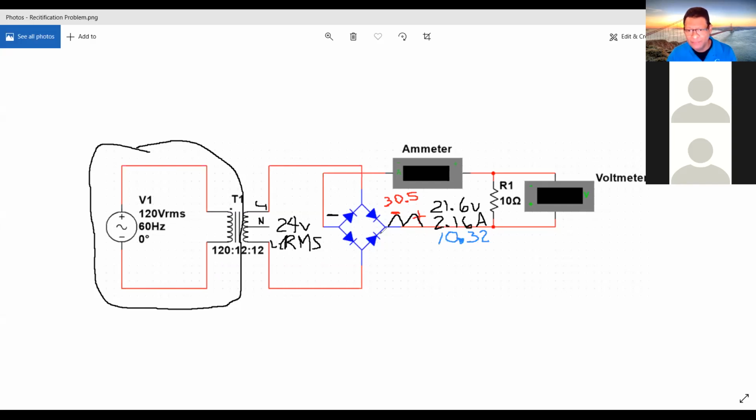So why is that important? Because this is the same thing that you are going to get in the shop once you get back in the tools. You are going to have to look at the schematic diagram, connect it, and then do all the calculations as well. You will have to do two things at the same time, calculation and measurement, because you're going to be able to verify that everything that you measure can actually be calculated effectively with the formulas that we have given you.